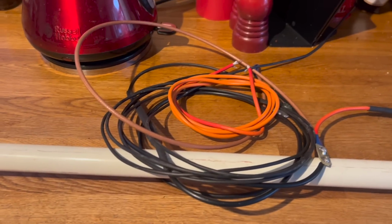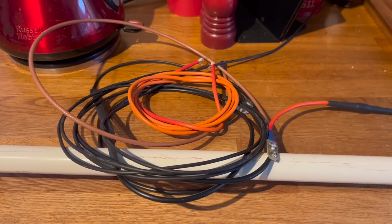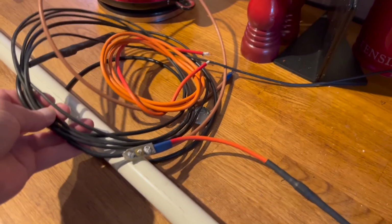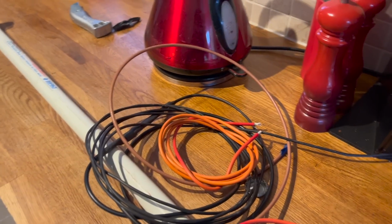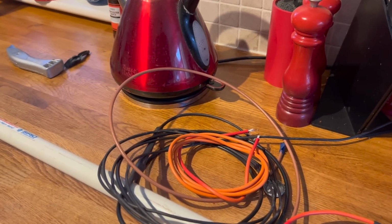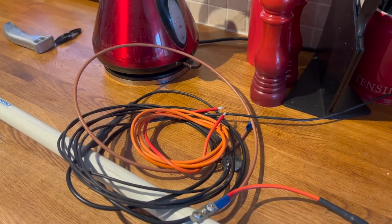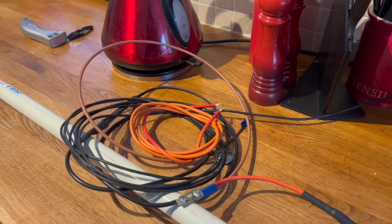I never put an antenna up and leave it there. I do like to experiment and play, as you all know. So I guess this is a little bit of my own fault. Anyway, it's developed a fault. The SWR has gone from flat, from 26, 27 megahertz through to 30. It was relatively flat, no higher than 1.5 to 1. And it's gone through the roof.